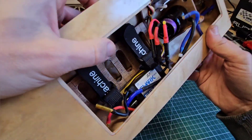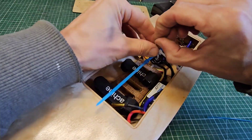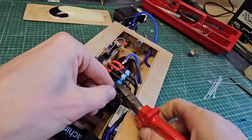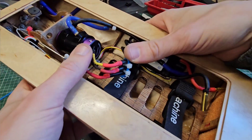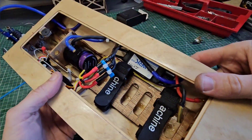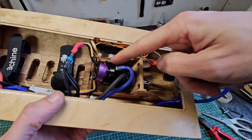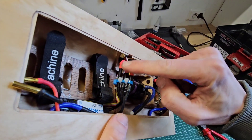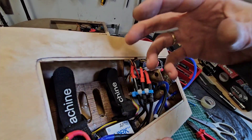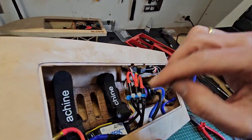I've got the motor installed. I also put a cooling jacket with the cooling lines and the 4mm gold connectors. I also spaced the wiring apart with tie wraps, because if these connectors are touching each other they generate a lot of heat. With the tie wraps you force them apart and the heat can dissipate easier.